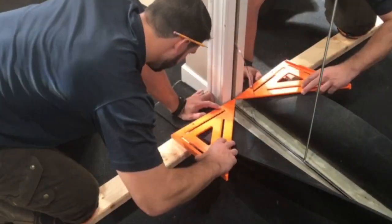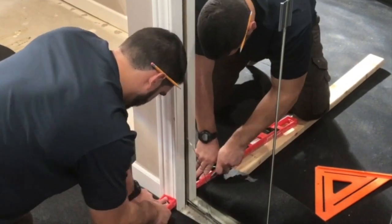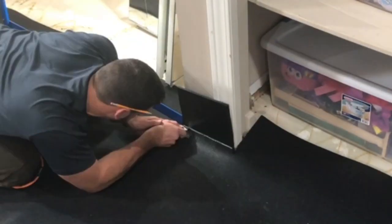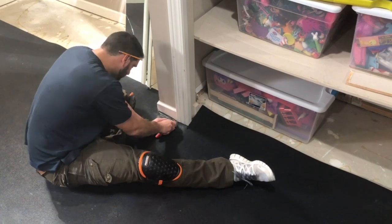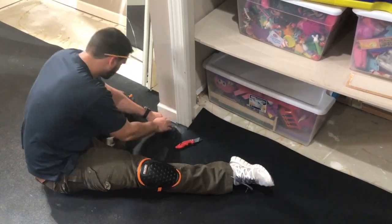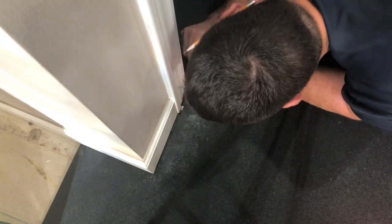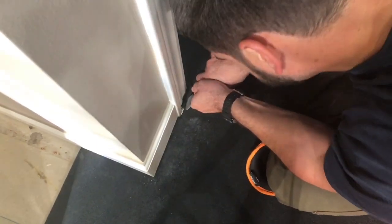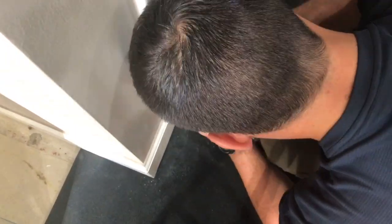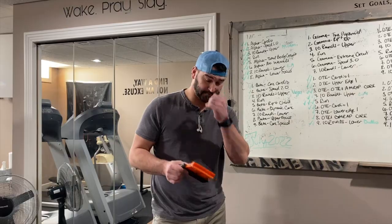Now for the fun part — where the closet comes in with these little outserts and molding. I made sure to cut the piece right to where the molding was and laid that down, using a small tool to push it in. I kept whittling it away around the molding making sure to protect the molding while cutting. There were a few small gaps I filled with scrap cutoffs, and it came out quite well — the second one came out even better after the first test run.